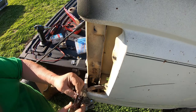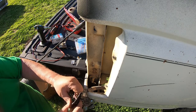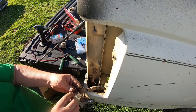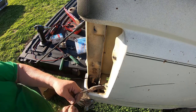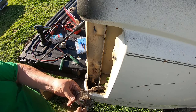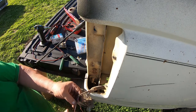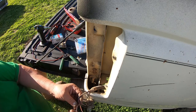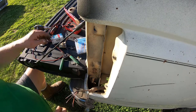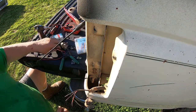We're going to strip off about a certain amount off of each one. Now what I have to do — the new plug, or the new socket rather, comes with just all-black wires, so one of them is the correct one. We'll take the meter and we'll ring it out.